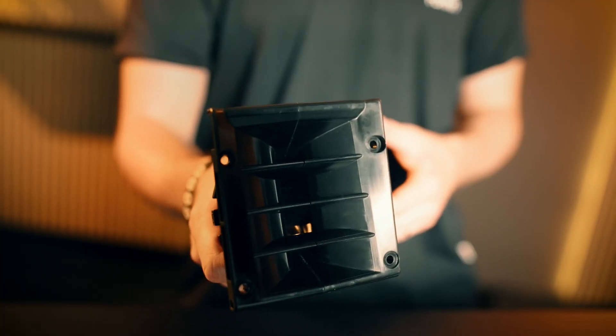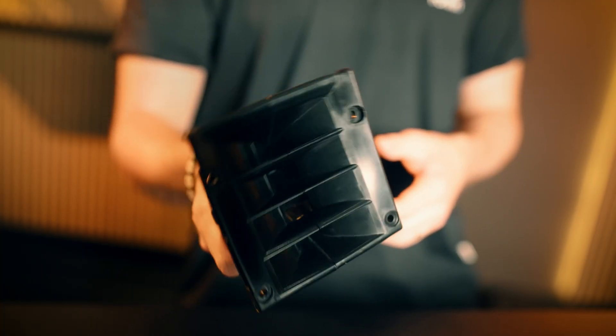To eliminate the need for mechanical tilt and provide even better visual integration, the new LXP hybrid line source speakers were equipped with a passive 5-degree tilt. As you can see, there is no need to mechanically tilt the speaker anymore. This acoustic tilt applies to both the high and the low frequencies. We achieve this in the high frequencies using the Source Division Waveguide, while a novel passive beam steering concept is used in the mid-low frequency range.